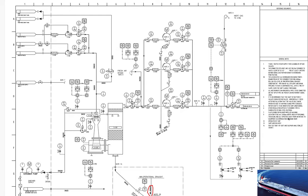The positioning requirement exists because these fans have a large suction capacity. If located near the accommodation air intake, they can interfere with the accommodation fans' suction. This would result in negative pressure inside the accommodation, which we try to avoid as much as possible.